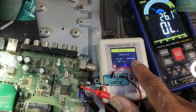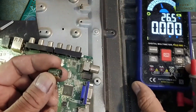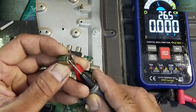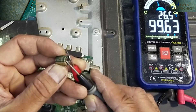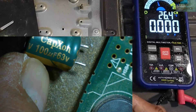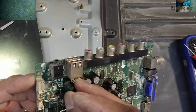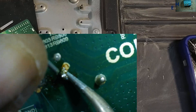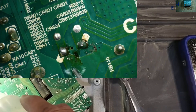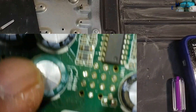Yes, it is 100 microfarad, 0 ESR — so this capacitor is good. I will use this one. Checking capacitance: 99.6, original value 100 microfarad, 63 volt. Now I will install this capacitor — take care for the polarity. Now I will remove this capacitor.